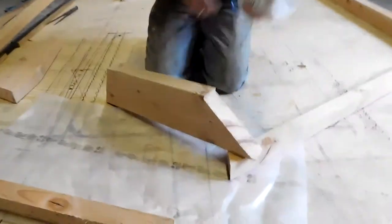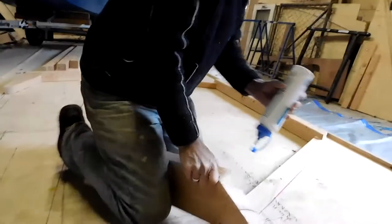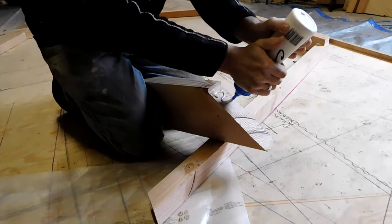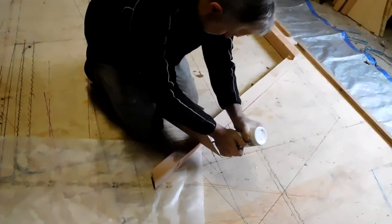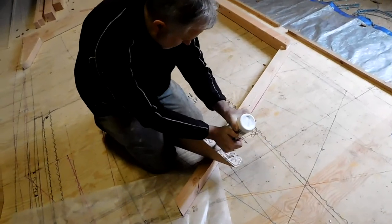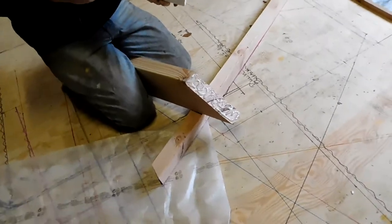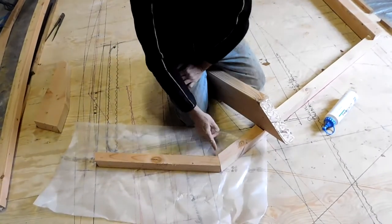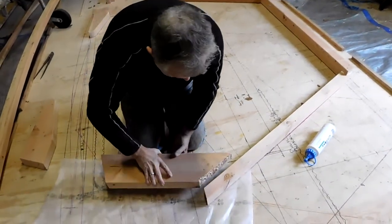I'm going to start here I think. Get a bit of glue on there. Put the bubbles up to fill all that quite nicely. Because I cut different angles on the ends of these, you can see the thicknesses don't line up. Obviously to get the same thickness you need to half the angle — I didn't do that. But I'll cut that little step in there so it fills the gap. Looks quite tidy I think.